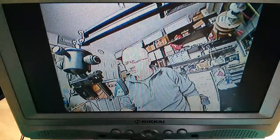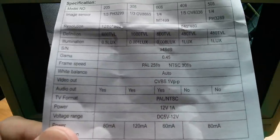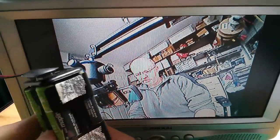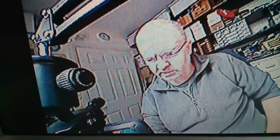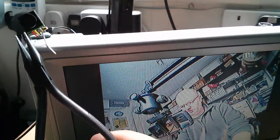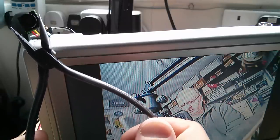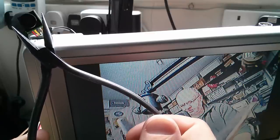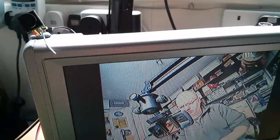It's clearly working, but I'm not sure whether the 12 volts has damaged it. It says on the instructions: power 12 volts, one amp, voltage range 5 to 12 volts. So I could try lower. With 4.8 volts from four nickel metal hydrides, that's a pretty reasonable image. Most of the pixelation visible is the low resolution of my LCD monitor. I'm now not sure this is a 12 volt camera — it certainly didn't like 12 volts. Testing the wide angle with my pliers, I'd estimate it's almost 180 degrees — so 170 degrees seems about right.